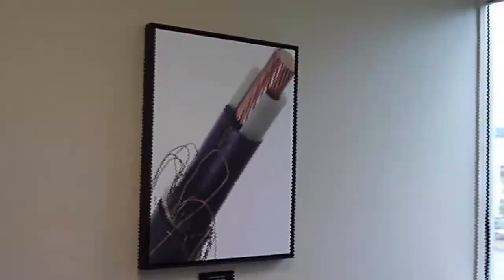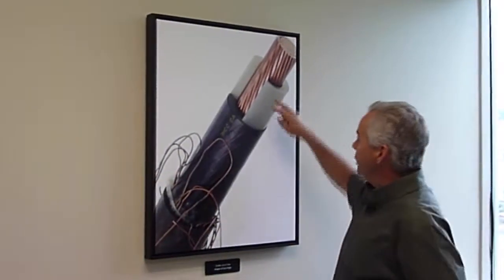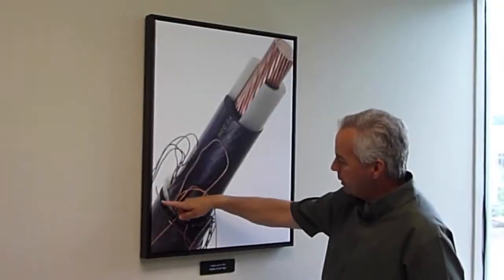And here is yet another glamour shot. You might notice a couple of things different about this cable than the previous ones we saw. We have a copper conductor, which is very typical in industrial settings and also in metropolitan downtown areas. You might notice the neutrals are a little bit smaller too. That's very normal for feeder cables. Then there's this mylar wrapping, and then a jacket.